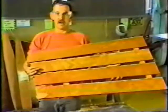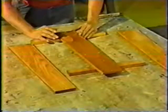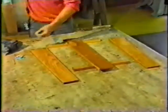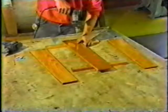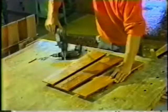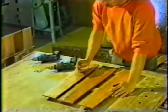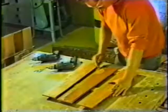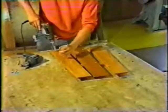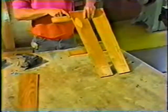Your kit will come with pieces for two floorboard assemblies. This is a completed large floorboard assembly. Both floorboard assemblies are put together in the same way. Start by placing the floorboards onto the braces so that the spacing between them is even. Install two pilot screws in each board. Mark the position of the boards with a pencil. Back out the pilot screws to apply the adhesive, using the pencil marks as guides to avoid getting the adhesive on the exposed surfaces.